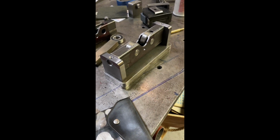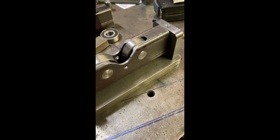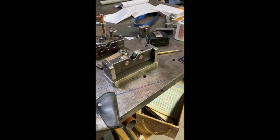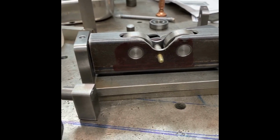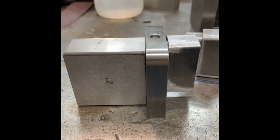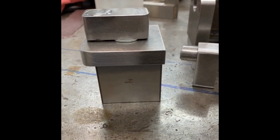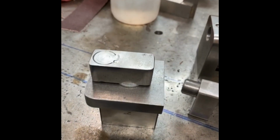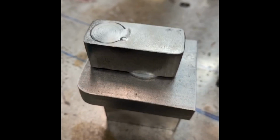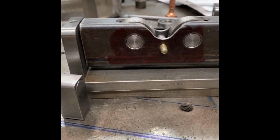And the fit-up seemed really well. You can notice that pin's too far back because it's not even set in there yet. Just checking myself, and we're going to move on to, let's see, I'm showing the welding of the pivot block, using a fireball square there that's magnetic. I've already welded, this was my setup, and I'm welding the pin in that small block there. Just a nice little fusion weld, didn't go crazy on welding, and that worked out really well.